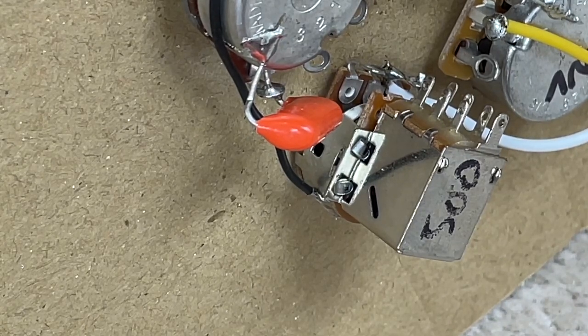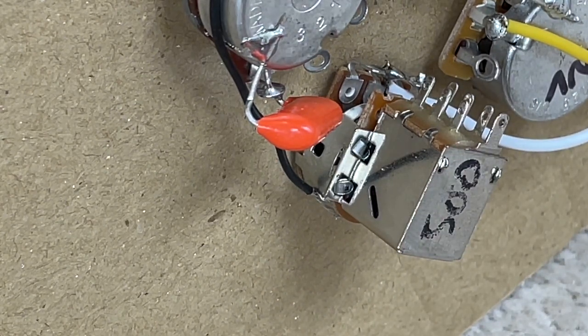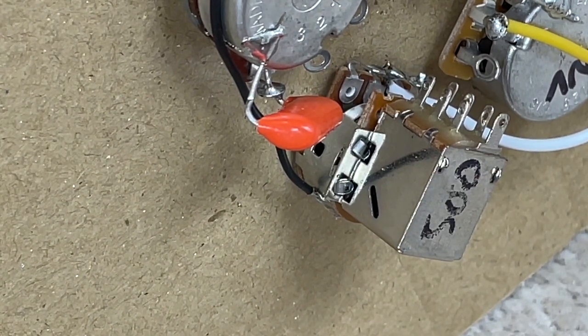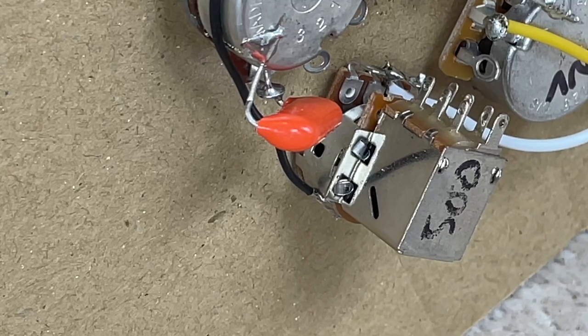Now we know that green comes in, so let's take the green, and we could possibly get these two wires together if we're very careful. So let's strip the green back. You can't see me doing this, but what I want to end up with is two very thin wires on the end of the green things. And if I can roll them together, then I can get them both in the same hole in the micro switch, or the double pole, double throw switch. If I can do that, then it saves me worrying. And I think I probably can.